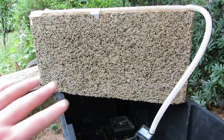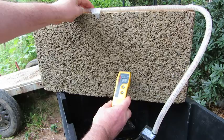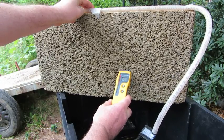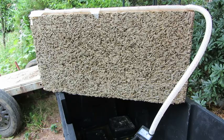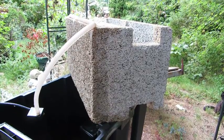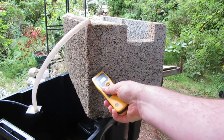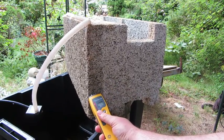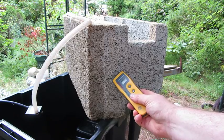If we have a look, we can see that the surface is still wet — I've just raised it out of the test chamber. The moisture content is at basically 100% within about half of my prong depth. Looking at the side profile of the block, this outer panel is wet and I'm getting about 30 to 70 percent depending on where the holes were and what the wettest areas were.